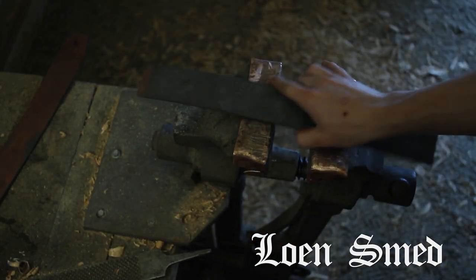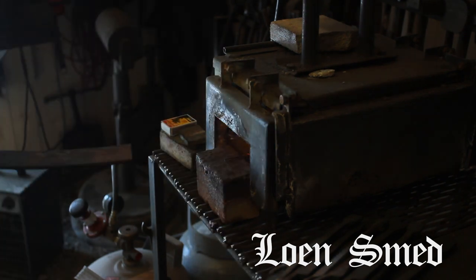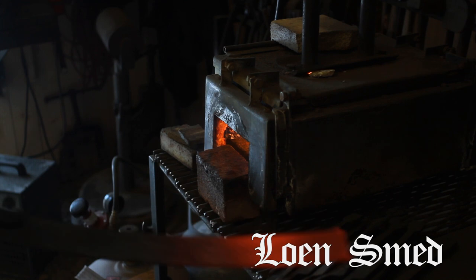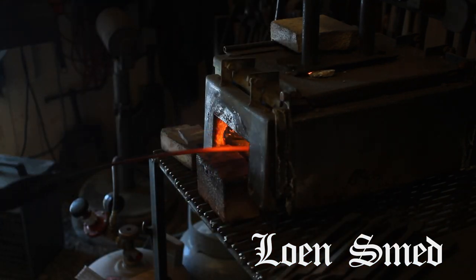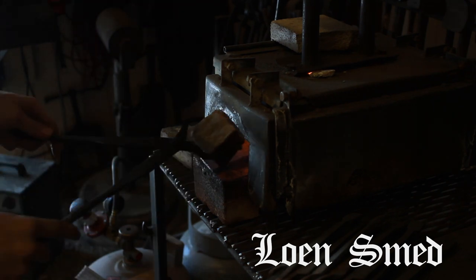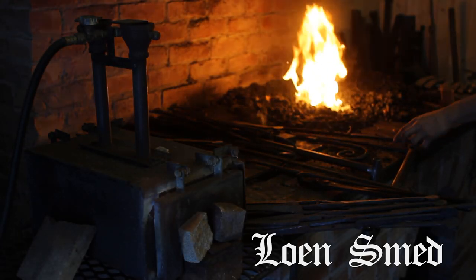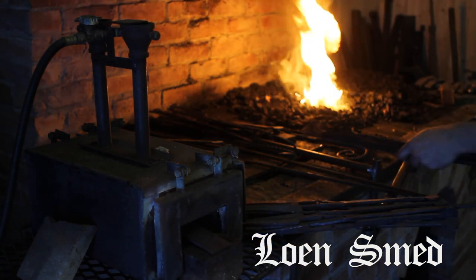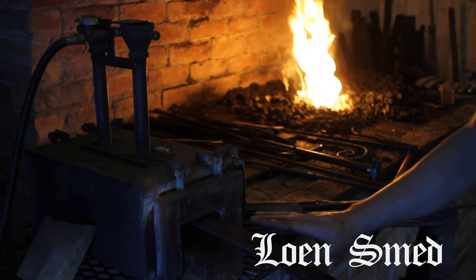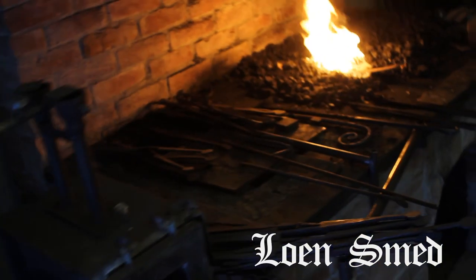And I'm using an old piece of leaf spring that I'm normalizing numerous times just to really make sure that it doesn't go all spontaneous and crack at me halfway through, or even worse, at the end. I think you see here the third normalizing cycle that I do just before forging. By leaving the leaf spring in the gas forge for a couple of hours, the cooling process is a lot slower than just leaving it out in the air, which then also makes it even softer and more normalized, or something like that.